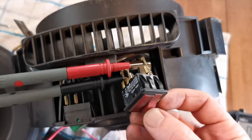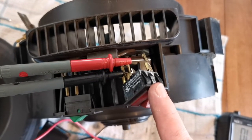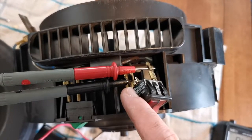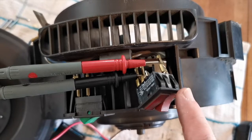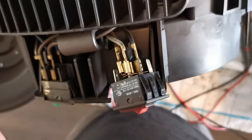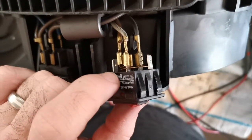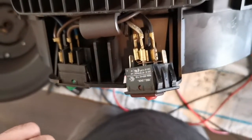So there are two things we could do at this point. We could order a replacement of this switch, or we could bypass this switch completely and just have the terminals connected so it goes straight through. Alternatively we could open up this switch and see if it's repairable. What I've done temporarily is connect the two terminals to the centre connections of the switch, which are connected together - that will bypass the switch completely. Then we're going to test it and see if that works.